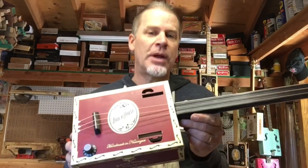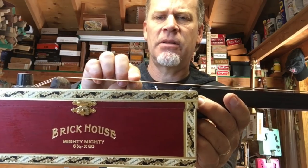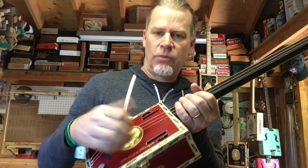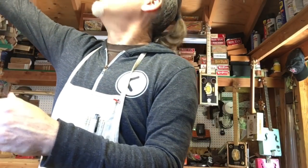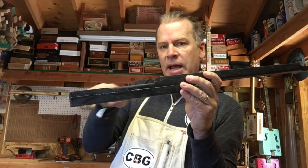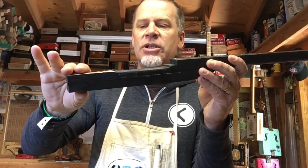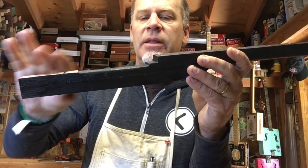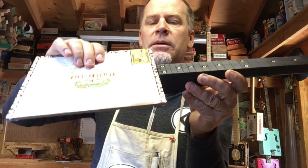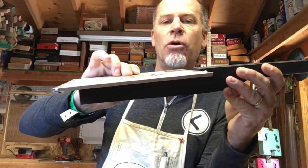The next tip is incorporating the back angle into your cigar box guitar builds. What I mean by the back angle is this angle here — it's thicker here and gets thinner as it approaches the fretboard. What that does is give you more action with your right hand. I achieve that while building the neck by cutting it at an angle, so it's about a quarter inch thinner at one end. In this case it's an inch and three-eighths here and an inch and one-eighth there, creating that subtle back angle. More information is in the video links in the description below.